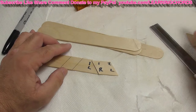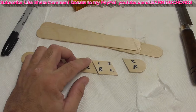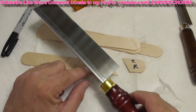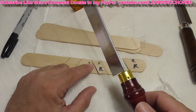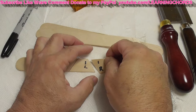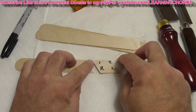This second cut was done with the small saw — took easily two to three minutes. Very fine cut, very smooth. This other cut was done with the large 24 teeth per inch saw — much quicker, probably a minute to a minute and a half. The only hard part is getting it to bite in without a vise. I'm not using the miter box, strictly doing this by hand to see how good these saws are. I feel no excess on either cut — nothing but smoothness on both.